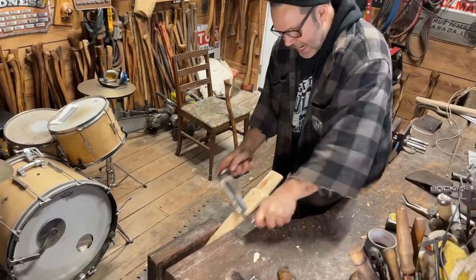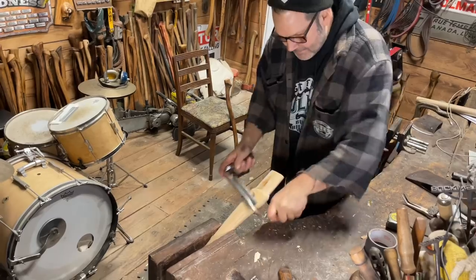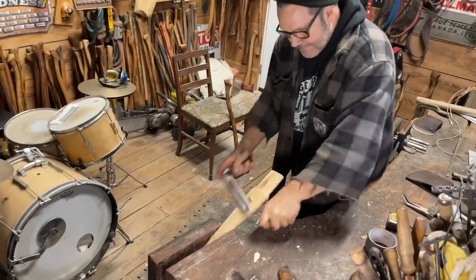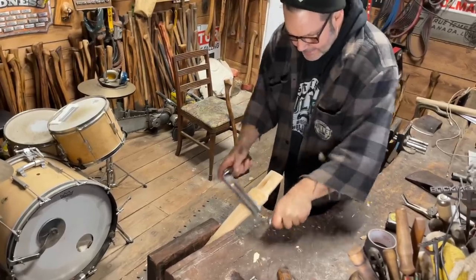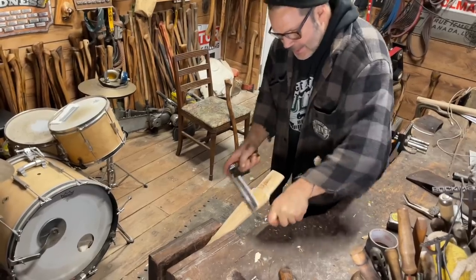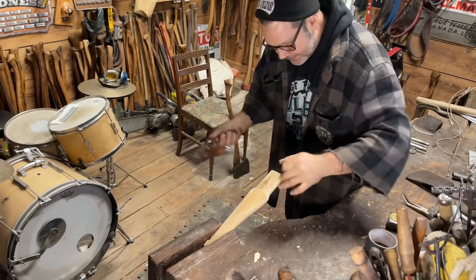Okay, this is the other side. This almost looks like, see what I mean, friends? This side doesn't do it. This is the heartwood side. Now be careful on that heartwood now. See the chunks we're taking? Turn your draw knife on a little bit of an angle so it draws in and cuts in. You'll probably have to blend the hump where you started.